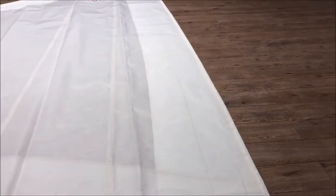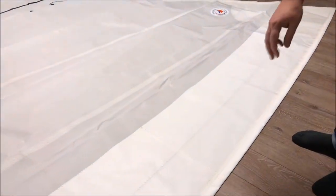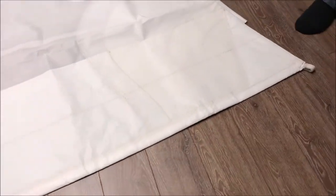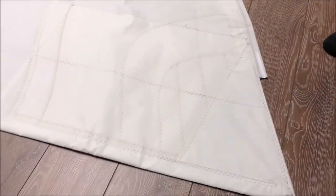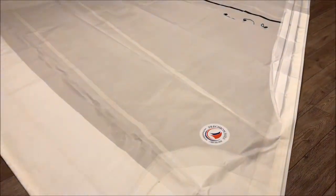We'll just walk down the foot here — there is a foot line in there as part of our offshore package. You'll notice there are two rows of tape all along the foot — it's actually all around the sail, but it's easier to see here. You can see the two rows of tape and the two rows of stitching. That brings us down to the tack. Again, just like the head, we use the webbing loops because they make those first couple of turns much tighter, which ends up being a better furl.